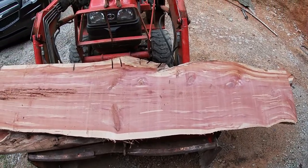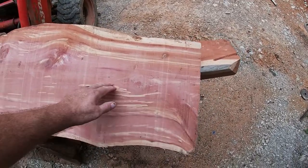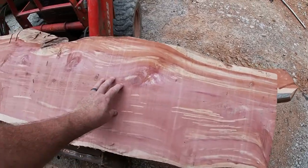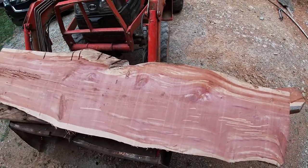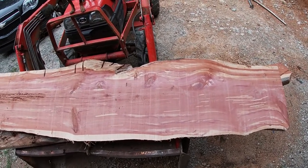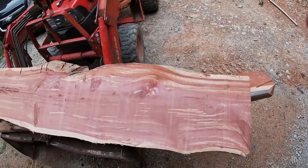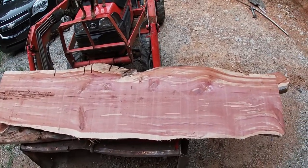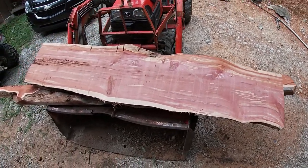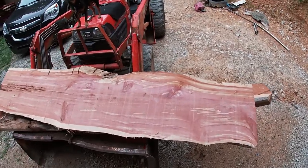But one thing you can do, say you had a bow through the middle, to save yourself a lot of grinding and cutting and trying to level, you can actually take it back to the band mill or sawmill where you got it from and let him just skim the top off and then flip it over and skim the back. Once it's dried, it'll pretty much hold its shape after that. So that's a tip that I taught myself years ago and saved me a lot of work.